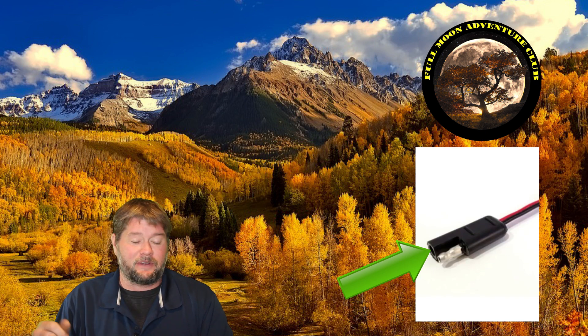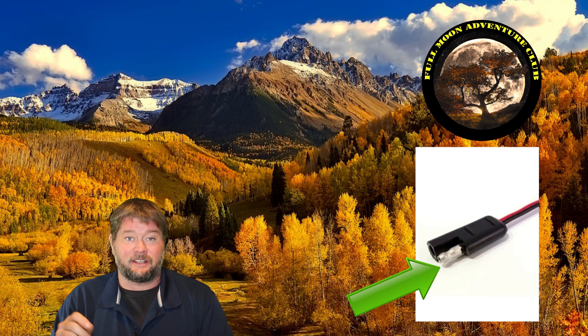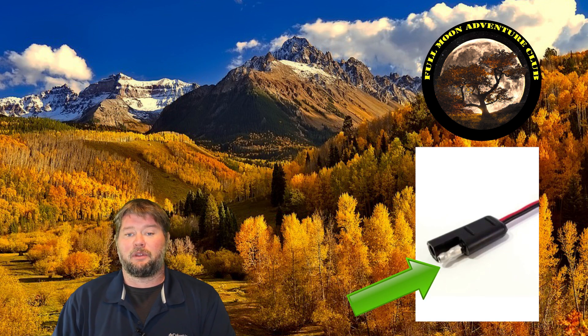Basically what it boils down to is whether or not the polarity of the wires is the same as the panel that you have. ZAMP's orientation of their plug is slightly different than other manufacturers. When I actually spoke with ZAMP, they said they basically did this to cover the positive lead in material so that it's a female plug — if it touches something metal it's not going to short out. So it's kind of a safety feature, which means the exposed metal pin is their negative on their plugs and solar panels in a lot of cases.